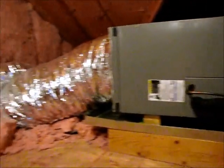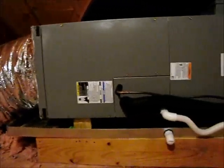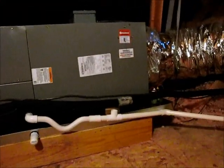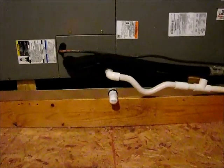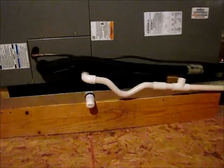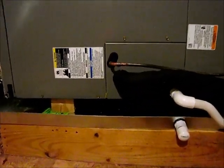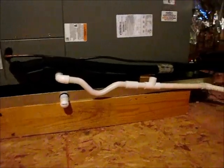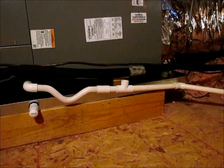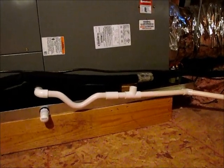So this is the final product. You can see the ductwork is nice and tight. The unit is level. The pan is larger than the unit in case you ever have any drips. You can see that there's a running P-trap on the system, a nice barrier of ArmaFlex all the way to the unit. The PVC line actually has a little T-trap there to blow out any unwanted debris for when we do cleaning services.